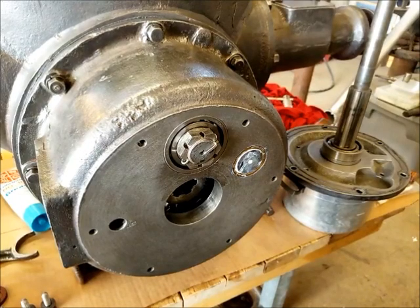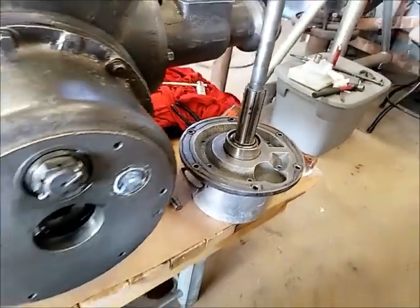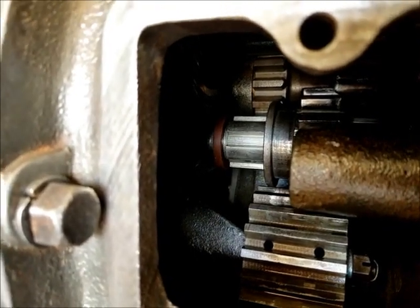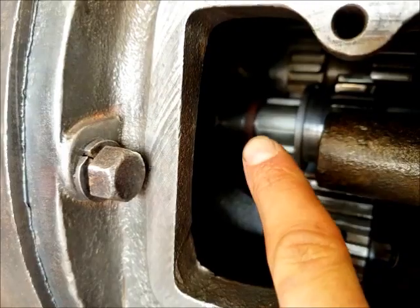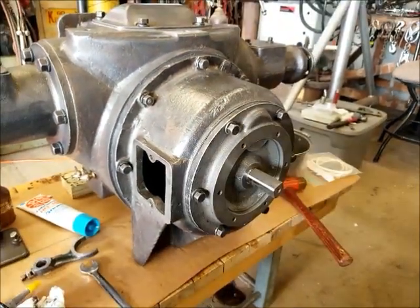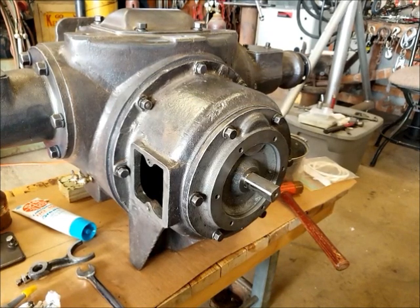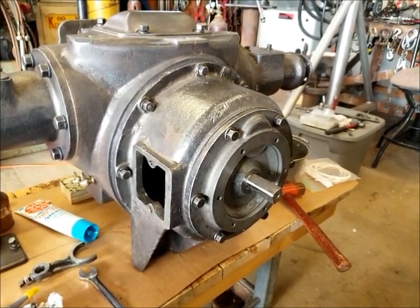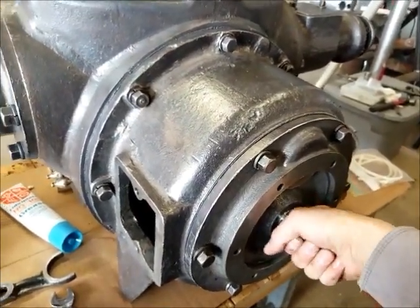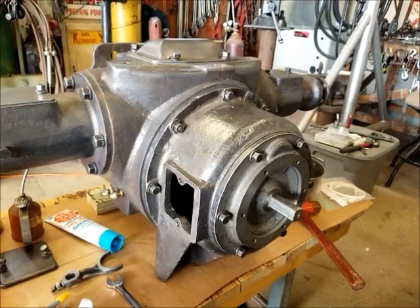Got a little assembly lube on the thrust end of that shaft, a little oil on the bearings, and Permatex ready to go. I got the slider gear on the shaft, the spacer pushing in the back, and the bearing started — tapped it into place. There's just a tiny little bit of ooze out like I like to see. All the bolts are sealed up and torqued down to about 25 foot-pounds. Shaft still turns smoothly — that assembly is good to go.